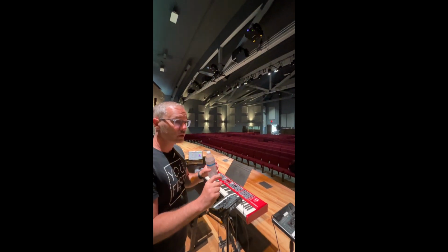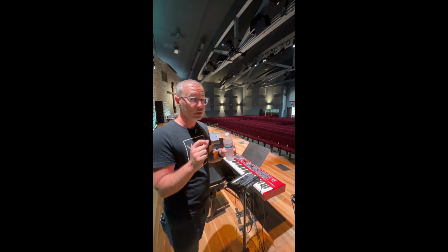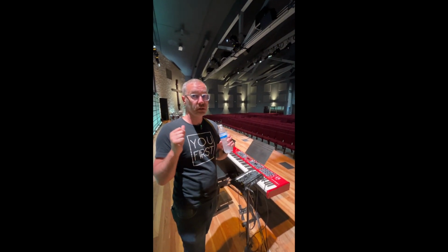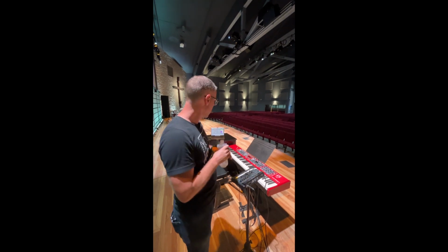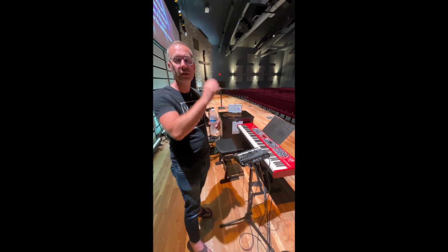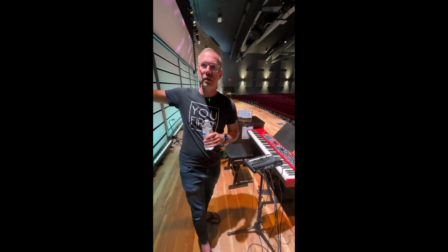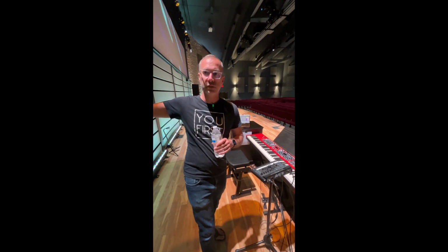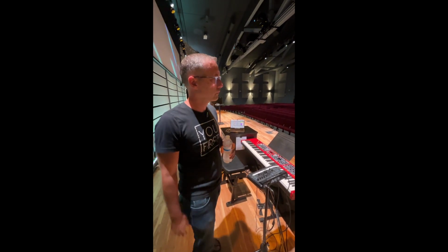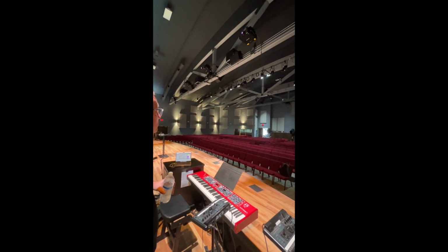So the little controller I was showing you, the DMX in the back room, is what's actually giving the commands out to the lights to go on or off, change color. And here, that little device, the DMXis, is what's sending, okay, here's what value I want, sending it to that device over the network. And that's what's listening, and then it sends the command to the light. So that's controlling all the lights in this room.